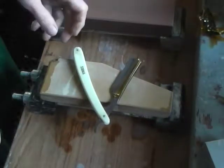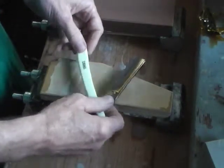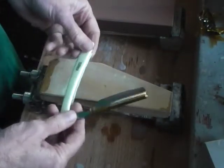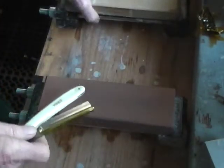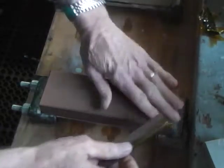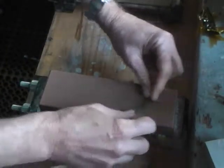Terry, this is going to be a completely spontaneous trial testing on this stone with a Towa razor, similar to what you have. I'm going to set the bevel on this 1000 grit King first. And I found out you can use some of these stones, like the King, with just a dry stone, no water or anything. So it's worth a try sometimes.